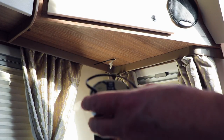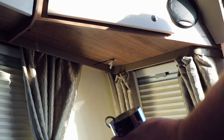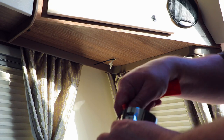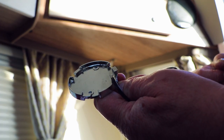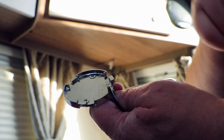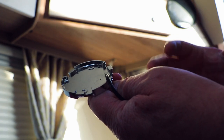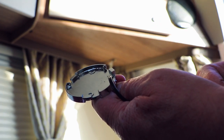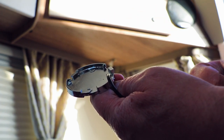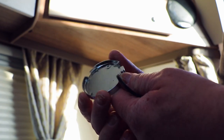So this is the new light and it comes apart very easily. It's got a plate at the back here which we just need to undo. To fit these in is extremely straightforward — we've got two screws which are supplied, one there and one there. That screws to the bodywork and the alignment I'm going with is north to south with these two screws. The cable entry goes through the existing hole in the bodywork and the plate just covers up nicely the whole mechanism. You may want to orient them slightly differently but that seems to be working for me.